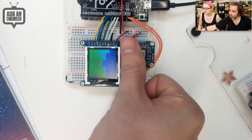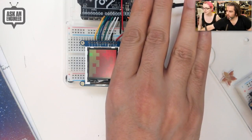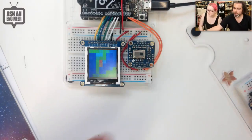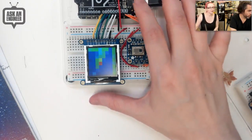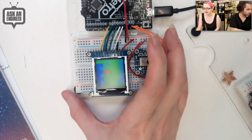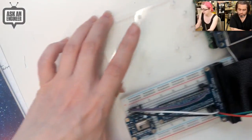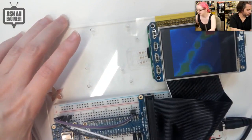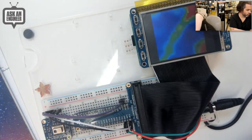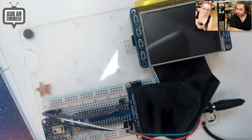Moving the hand around, you can see individual hot spots — super warm in certain areas. With a Raspberry Pi you can use the filtering capabilities built into Python using scipy to do bicubic interpolation, taking the 64 points and turning them into many more, getting much higher precision. You can move your fingers and see individual points, and you can also see the fluorescent lights above on the sensor.